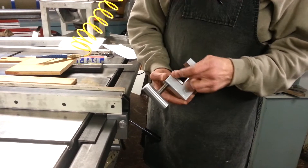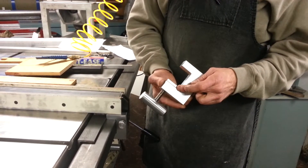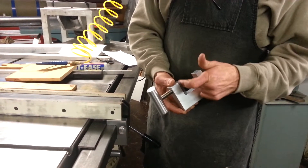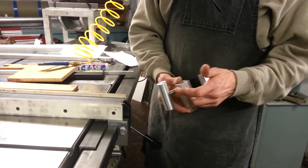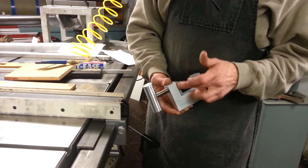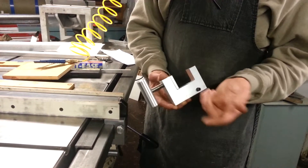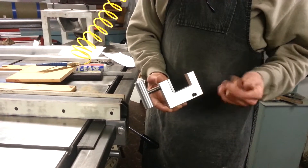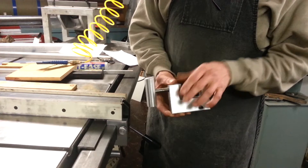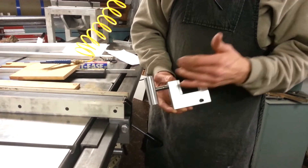The pressure plate, finally, is a piece of 1018 bar stock. We went with steel there because we wanted a more robust material with the set screw going in contact with the pressure plate. We could have gone with aluminum, but we felt that wouldn't be a really good choice. So the only part that is steel is the pressure plate.